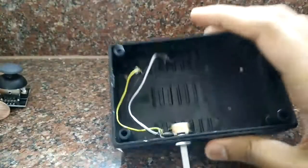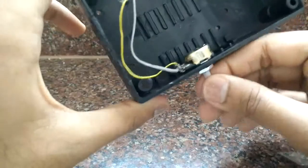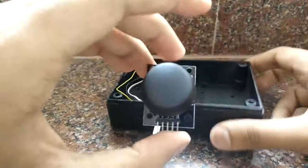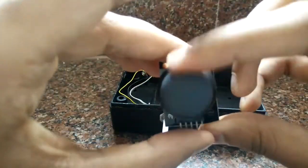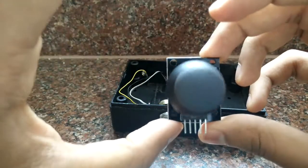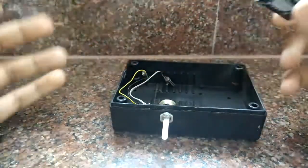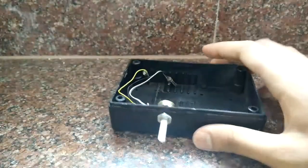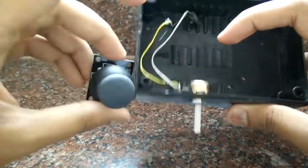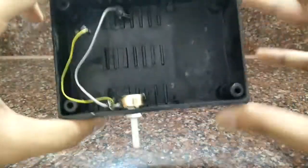I can't easily remove the spring, and you might not know how much thrust the four motors will produce. So I'm using a potentiometer for throttle instead. Since throttle doesn't need fine rapid adjustment, a potentiometer should do the job. Ideally, you should use a joystick module without a spring dedicated to throttle — I couldn't find one in India and importing one costs more than $20, which is too much just for a joystick. So for now I'm going with the potentiometer.